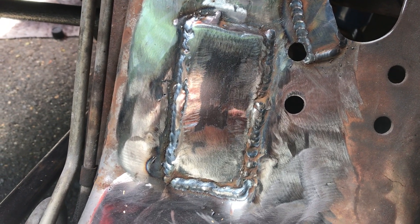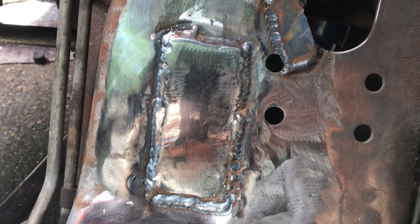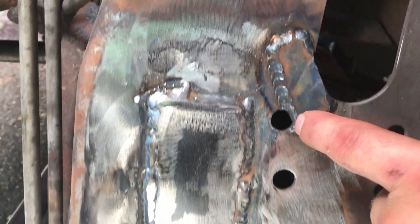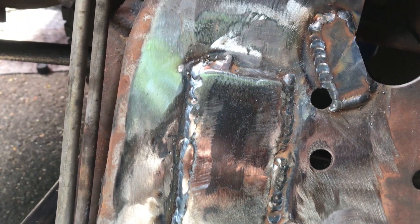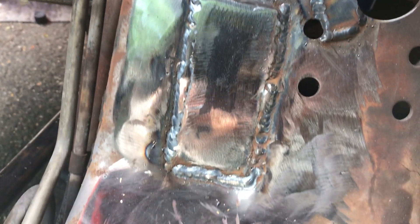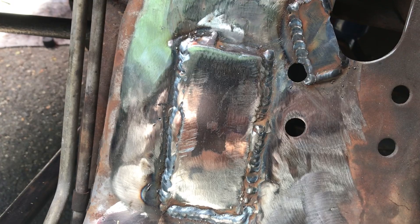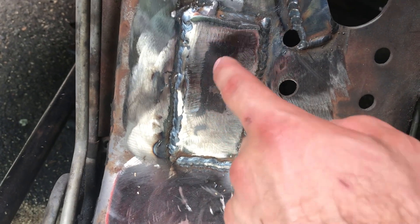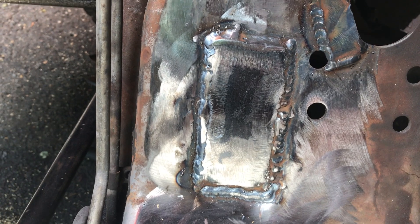The last of the welding is finished. Please excuse my welds — I'm literally standing in the engine compartment, it's not the best. I added another plate on the backside, and because this crack traveled over here, I added this other reinforcement plate there to deter any future cracking. Although I have a feeling this might just do the trick. The next step is to take the bracket, line it up underneath, and mark out where we need to redrill the holes.